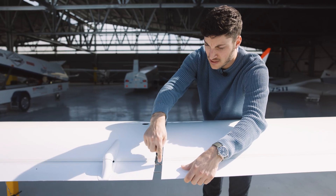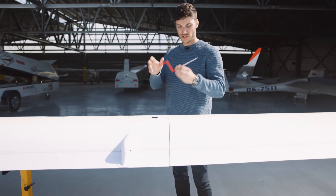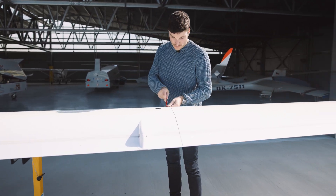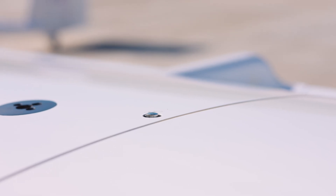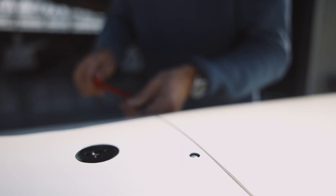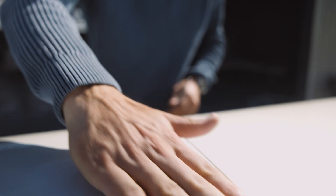Take care with these pins so that the flap and aileron are aligned. We use our special tool here, and you can see this one is moving down. At the end, go half a turn back and you're fine.